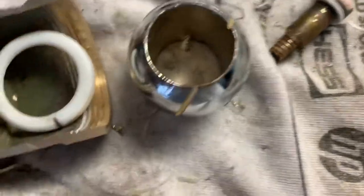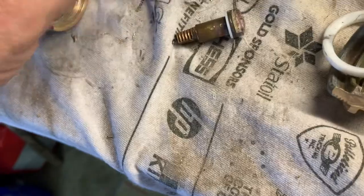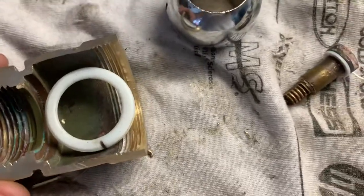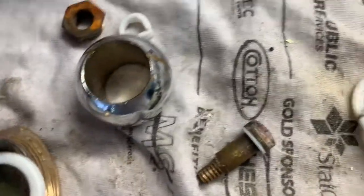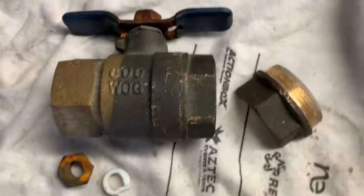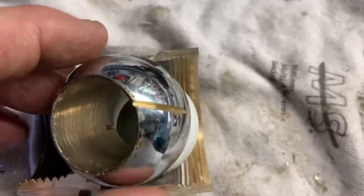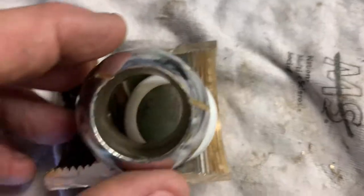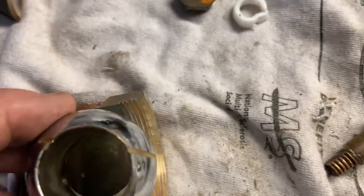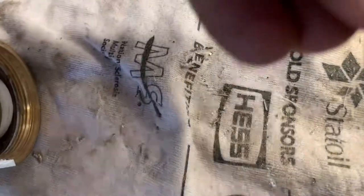So basically that's the inner workings of the ball valve. I found it kind of fascinating how you would be able to take this apart. I'm going to keep trying to remove this seal somehow — maybe get it on a bigger bench and try to get that off. The interesting part is once you get it open, turning this valve so that you can then pound it from the other end or extract it, because it has to slide off of this channel, oriented like that.